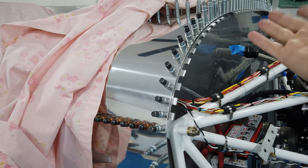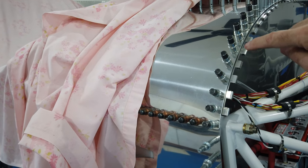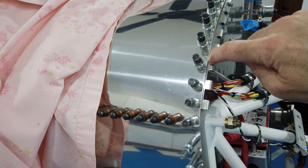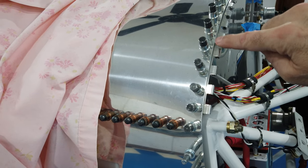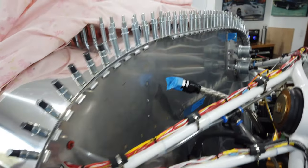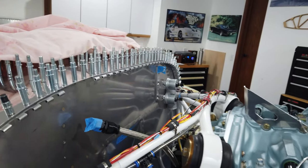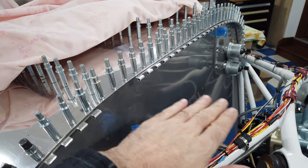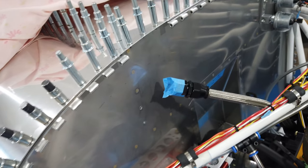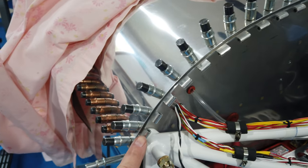Same process as the other side. Edge distance from the back of the hinge is about three-sixteenths — that makes the hinge stick out forward a little bit so when the cowling is in place there won't be any gaps underneath and no knuckle gaps when you look down the seam. You can see the gap here between the hinges — that's roughly where the oil door will be, the hatch on the cowling so you can get to your dipstick.